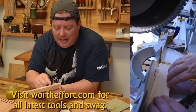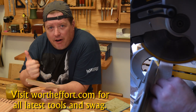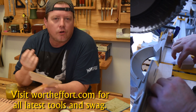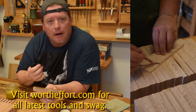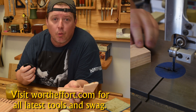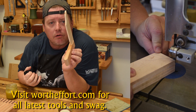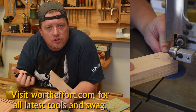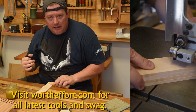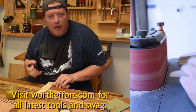In use over these years I have come up with some ideas for improvements. Specifically, in the video I'm showing you the production method I used to make these. So yes, once again I show you how to hand make it with hand tools, and now I'm showing you how to do a production run — giving away all the secrets and asking you to buy from me. I cut a slight recess right underneath the handle that's a tad bit bigger than the handle, because I found that when you're doing hand tool work or hand sawing, a lot of times that corner has a little schmutz or fibers there. This will still engage the wood slightly below that corner and give a little relief for any schmutz, giving you a more accurate cut.